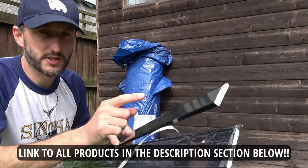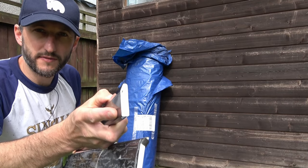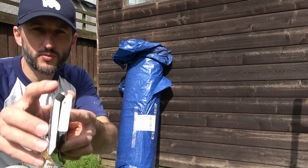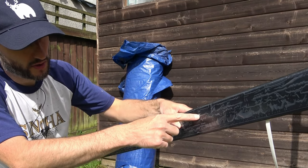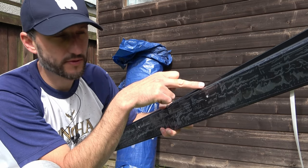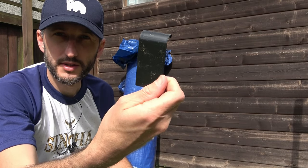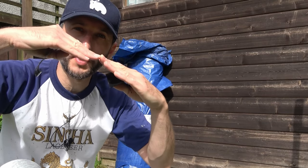Something specific to my project is this drip trim, usually used where water runs off the roof where people have gutters. The first part is put up against the eave of the shed and nailed in with small stainless nails. Your EPDM rubber goes over the top, then the second part fits straight over with the rubber sandwiched in between, and we go through with black cap nails through the top piece of plastic into the timber shed. The top piece has pre-drilled holes and connector joints are provided to hide joins, plus four corner trims - though those won't work on my apex roof.